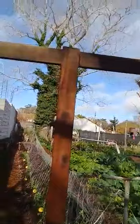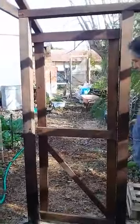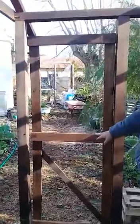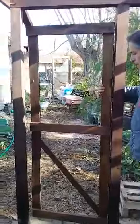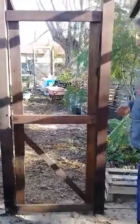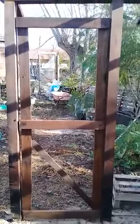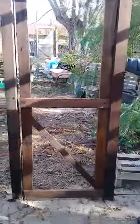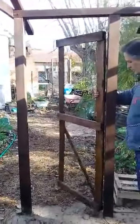The other thing we did was to place the door. This is the door. The door has 70 cm of width and is also made of 3x1. When we install it, we have to leave 2 cm of clearance, because as the floor is irregular, we need to be able to open and close it without touching the floor.